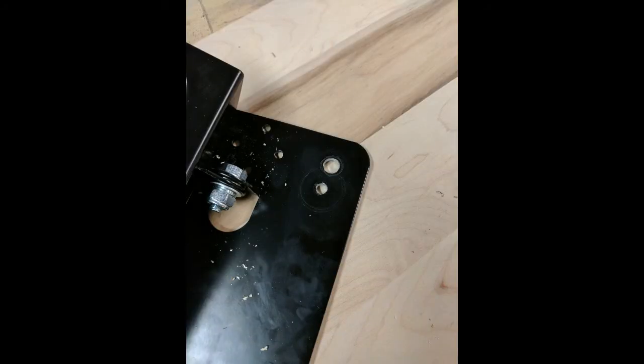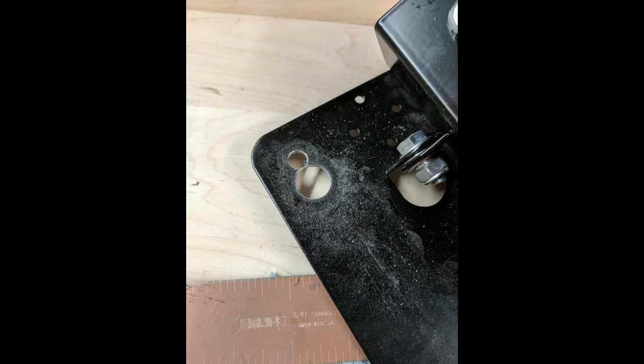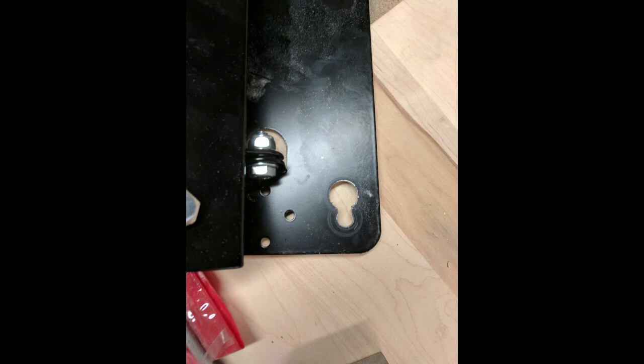Then I drilled another hole below it with a drill bit. The smaller hole is the one I just drilled, and I used the step drill to drill it out bigger. Then a jigsaw or file would turn that into a tab shape. This is the kind of tab you often see on the back of something that mounts — like the back of every power strip you have — a small hole that is the actual mount, and then a bigger hole which is big enough to take the screw head, the head of that lag bolt.